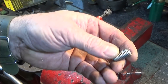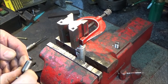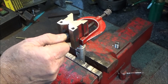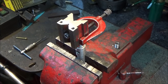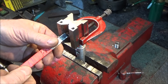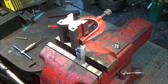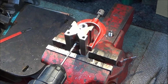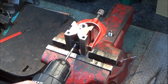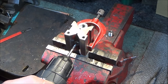To do the drilling, I have a piece of 12mm threaded rod that I've drilled out for the core diameter drill I'm going to use, because I'm using a 2BA tap. That screws into the V-block — I've ground up a piece of hacksaw blade to screw it right home. It screws down onto the bar; there's no need to over-tighten, just nip it up so it's full depth. Now I can use that core drill to drill straight through. The bar's hollow so it drops in a bit. I withdraw the drill several times to clear the swarf, and I know the hole is going to be dead square in the bar.